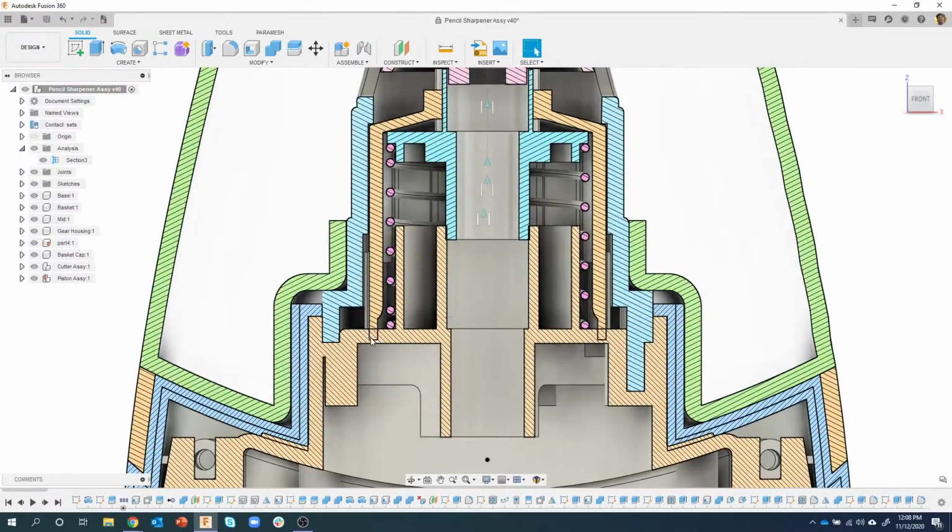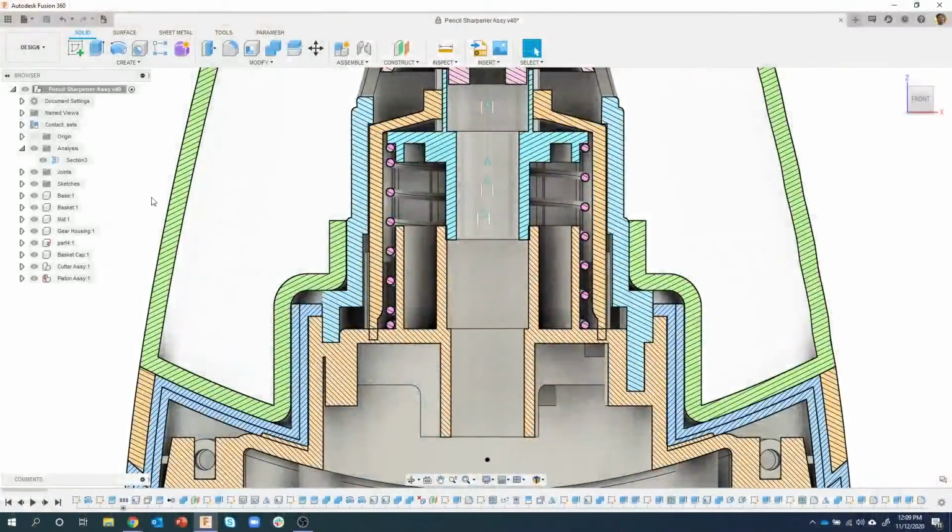Now, some of you might just say, oh, click that bottom face of that part and drag it up the correct distance. And that's valid, but remember we spent some time creating sketches and adding dimensions and all that kind of stuff. Technically, it's better to go back and change dimensions and change your sketch instead of dragging faces. Don't get me wrong, I love direct editing where you just click on something and move it. But because we spent the time doing the parameters, the dimensions, etc., we should go back and change the sketch. So that's what we're going to do in this case.